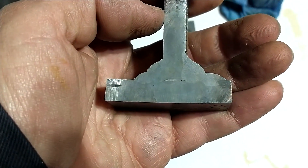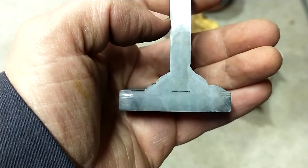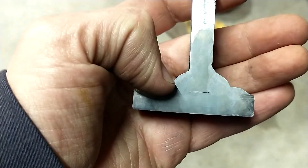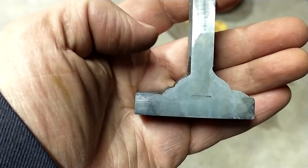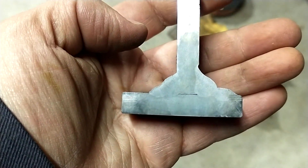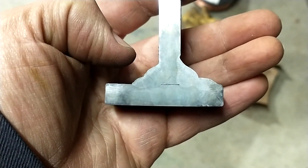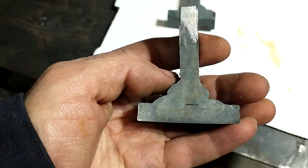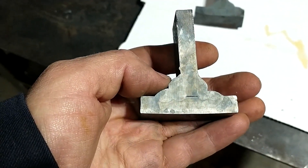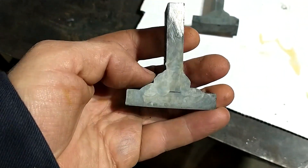So this is the dual shield here. The dual shield did decent, but it didn't penetrate that deeply, to be perfectly honest. And this one's really hard to see — this is the MIG on 180-amp settings, and it still fused pretty close to all the way through to the root, and it did penetrate a little bit, but not as much as the dual shield obviously. But overall, I'm surprised that the short circuit MIG on CO2 went that deep. And honestly, out of all these, I would go MIG — MIG with CO2.